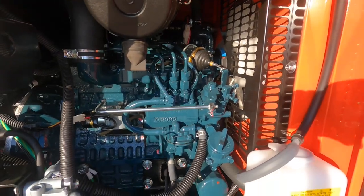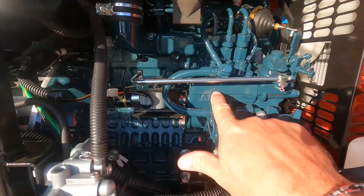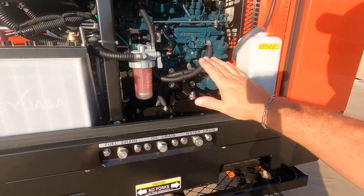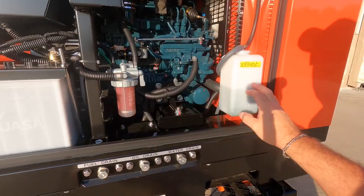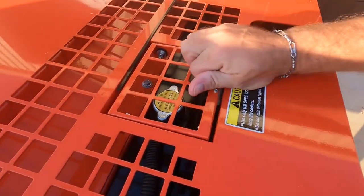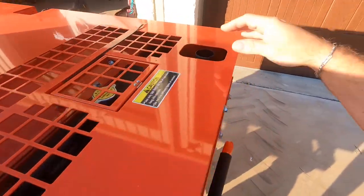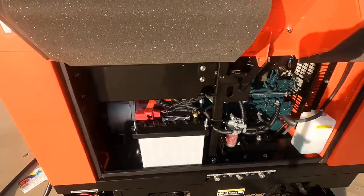It's got a little three-cylinder in here — it's the D series, the D902, stamped right there. It's just a nice little gen set. It has 100% containment with a pan and a shutdown for all the fluids — water drain, oil drain, fuel drain — very easy to service. It's got your air filter here, fuel filter here, coolant level, radiator cap under this little grill up top, and your exhaust right here. It pulls intake in from that side panel and exhausts the radiator air up, and pushes exhaust fumes straight up too.